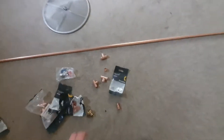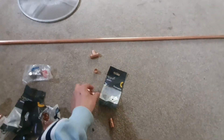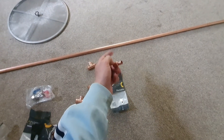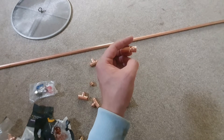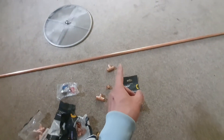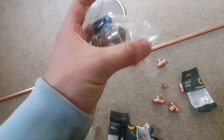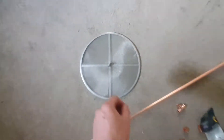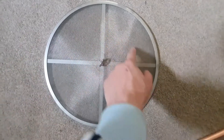I've got some bits and pieces together: some 15mm copper pipe, two-metre length, some 15mm T's, some end caps, and these reducers which bring us down from the 15mm pipe down to a 10mm outlet. What we use these for is to clamp on with a hose clamp for the three-eighth inch hose. Obviously if you're not using copper pipe make sure you're using food grade hoses. There's the washing machine outlet valve and we'll put the red tap on that to denote that it's hot - just because it's a nice finish. Then we're going to use this lid off the mash tun as our template so we know how big to make the loop, so it sits somewhere in the middle of the grain.